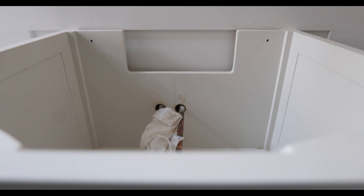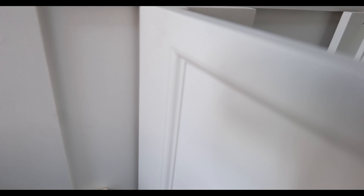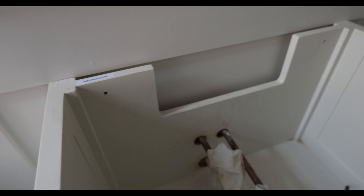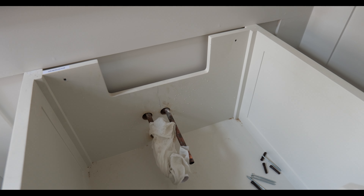Because we've got this panel in the unit it won't actually sit totally flush to the back of the wall, so we're just going to put some packers behind it and then secure it with two screws inside and a washer, and then we can get the isolation valves on.